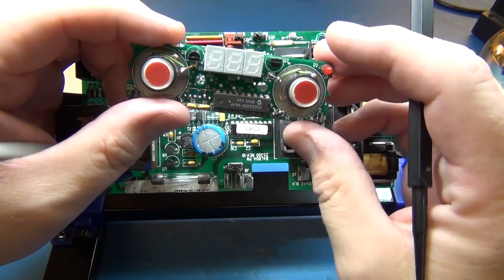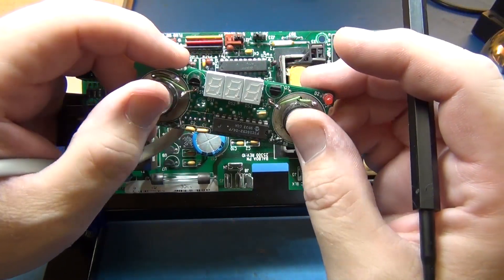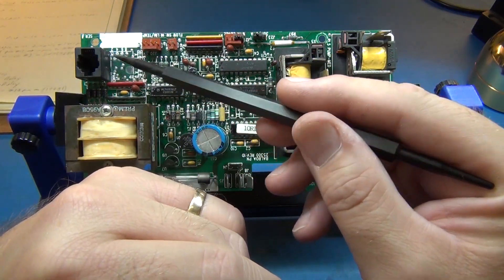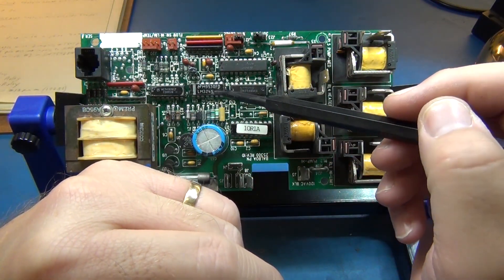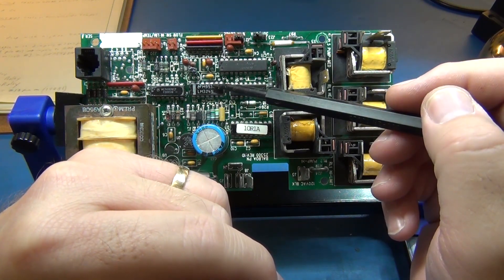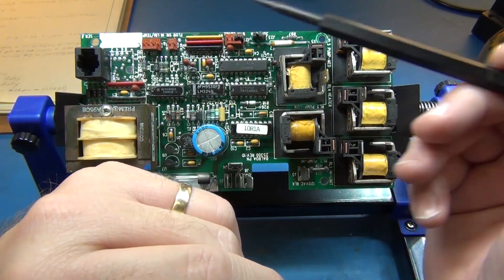The temperature was set too low to be a hot tub anymore. And this controller — though these buttons work now — they do feed through this RJ12 and go to the micro and tell the micro it wants to change the temperature, but the micro is ignoring it. That's where I certainly gave up on this board.